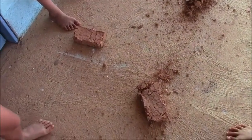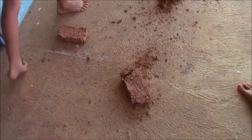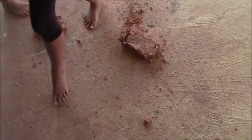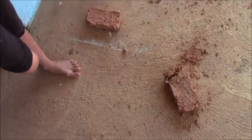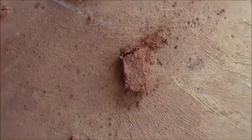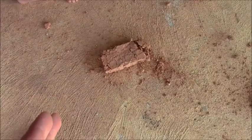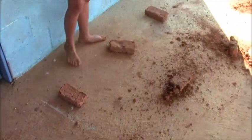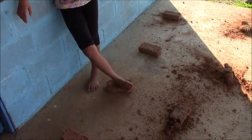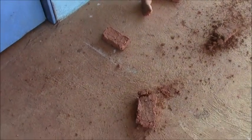Which one would you build a house from? The 100 percent clay brick may not look aesthetically pleasing with all the cracks, but to get rid of the cracks we'd add sand — maybe 33 percent or less. We can also increase the straw amount. Next steps: keep experimenting, mixing with a little less sand, between 0 and 33 percent, and make smaller brick samples that dry faster.